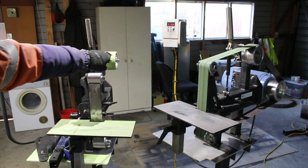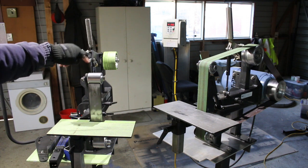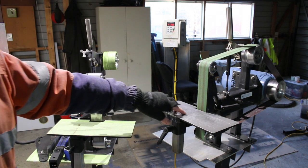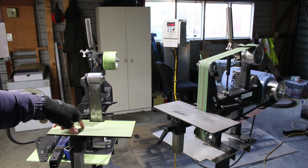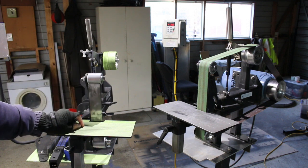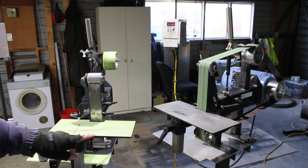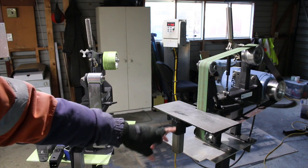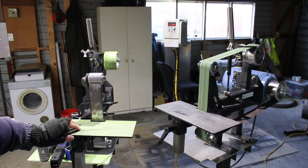Like I'm saying, I get the wheels level with the machine and then all the tracking is done on this upper adjustment. One thing to keep in mind: when you're going forward you'll be going that way, but when you turn the machine around you're going in reverse and you've got to track it the other way. On my prototype machine I'm not sure what happened, but it still goes in reverse really good — it just doesn't track quite the same. This second machine I got it right. I can put a belt on — I have run it with that motor just to try it — and you can get it tracking in forward, put it in reverse, and you don't have to worry about tracking at all. You can also note a few improvements with the second machine — the table frame was too high so I've lowered that to a better position.